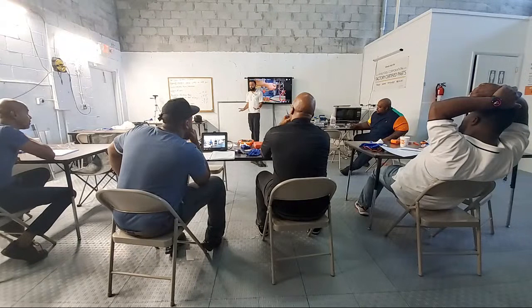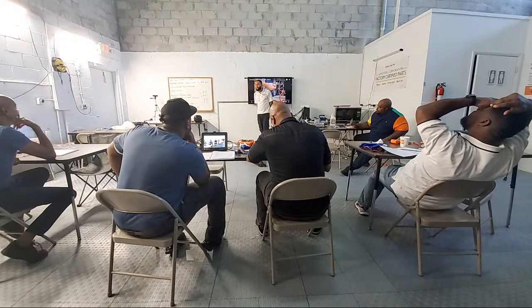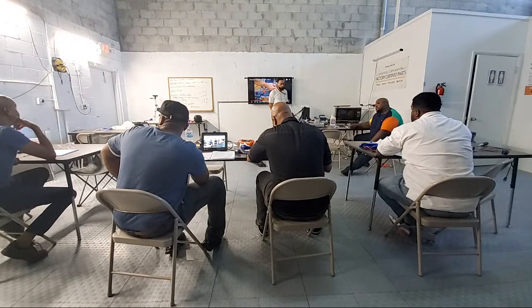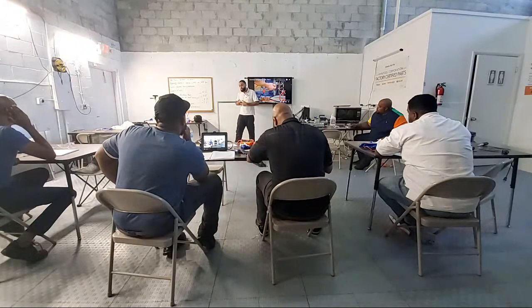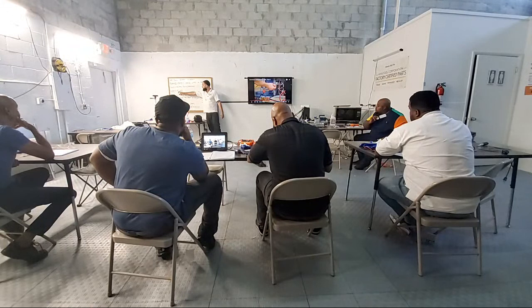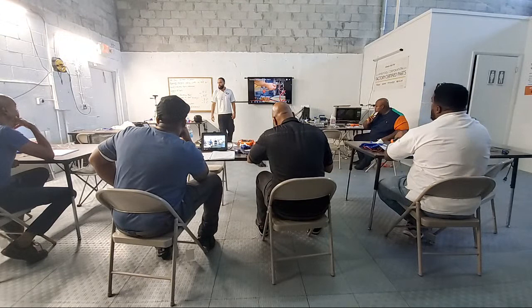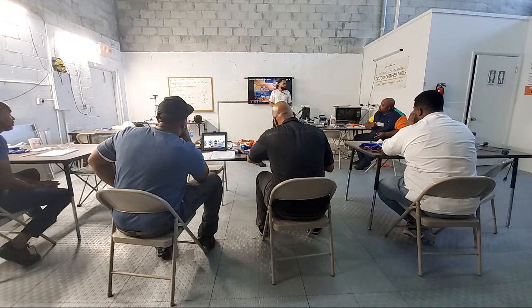What is a process that we can do? Remember, we have a restriction. We're trying to clear the obstruction. We're trying to use a substance to push that out, to remove that from the system. And we said that nitrogen is a good aid. But when we do that, we're going to flush the system. We spoke about isolating the system. You guys remember that? If we isolate the high side, now the flow is free to open again.